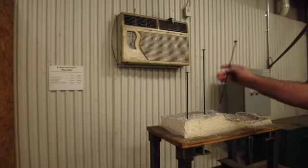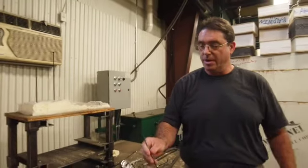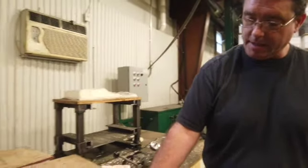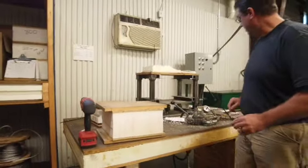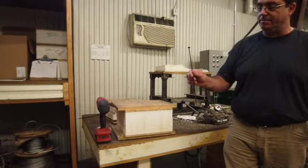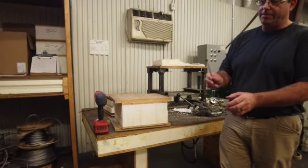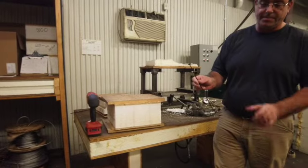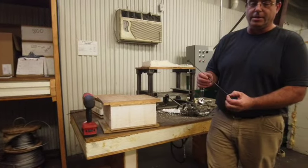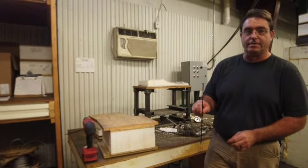So these are all the fasteners that we use to go through. They go all the way through the panel into the supports. Obviously this one's too long, but depending on the thickness of the panel, we use a different screw length. They have about 3 inches of thread, but with these particular screws, about an inch, inch and a half is usually the design factor for the fastener.